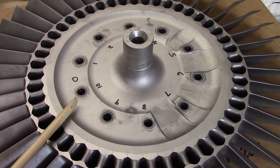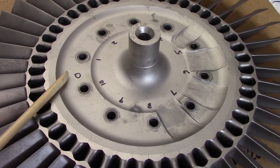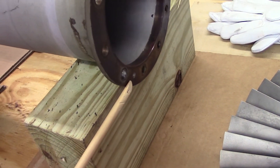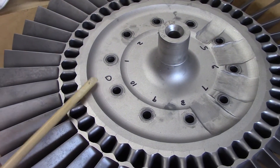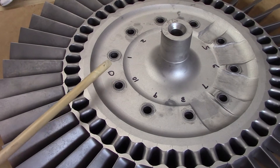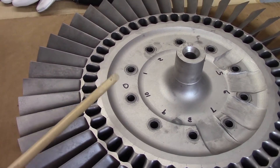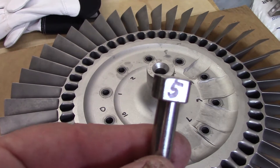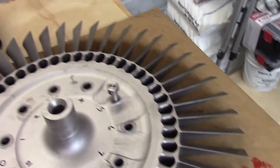On top of Jay's original installation, I marked each one and indexed it. This is where the dowel locator pin is on the other side, which matches with the little hole here in this flange. Once I established that, I went clockwise one through ten all the way around. I also numbered all the bolt heads — so bolt five goes to position five, and so on.